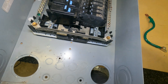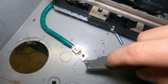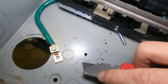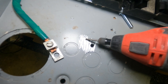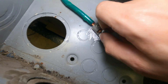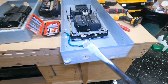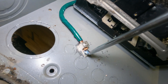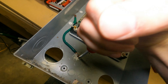See how it's making the threads — those are quarter-twenty threads. Now something important: you want to scratch this paint because paint is not conductive. Mark out where you're going to be scratching the paint, then get a wire brush and knock all that out. Now we're ready for a solid connection. The screw just threads right in there, and you can put quite a bit of torque on it because it's properly threaded.